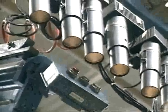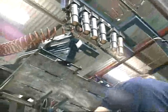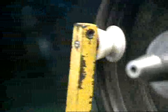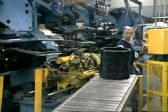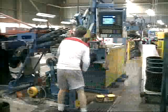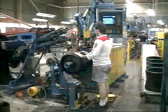Focused electric eyes above shine alignment marks on the building drum as the tire is being built. This barrel is almost a finished tire. This operation rolls the barrel into something that looks more like a tire. The resulting doughnut is inflated and has its tread applied.